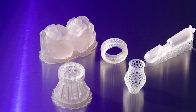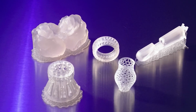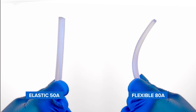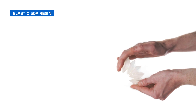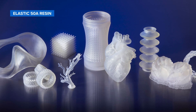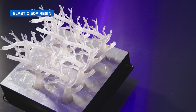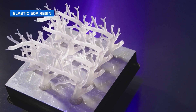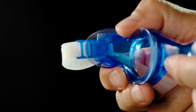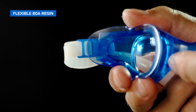If you are looking for a different hardness, there are also high performance elastomeric 3D printing materials with silicone-like properties that can serve as alternatives for rapid prototyping. These resins are harder, semi-translucent, and have a lower entry price. Elastic 50A resin is a 50A Shore durometer material ideal for producing soft, flexible prototypes.